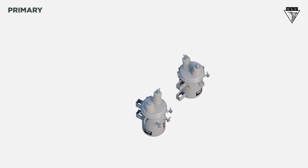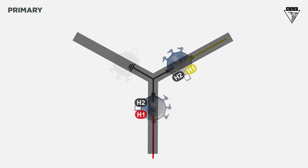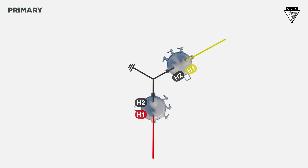Let's move on to the open Y bank. Attach a wire to the H1 bushing on the first transformer, then a wire to the H1 bushing on the second transformer. Finally, connect the H2 bushings together and ground them. This connection is also missing a transformer, leaving the Y configuration open, which is why it's called open Y.